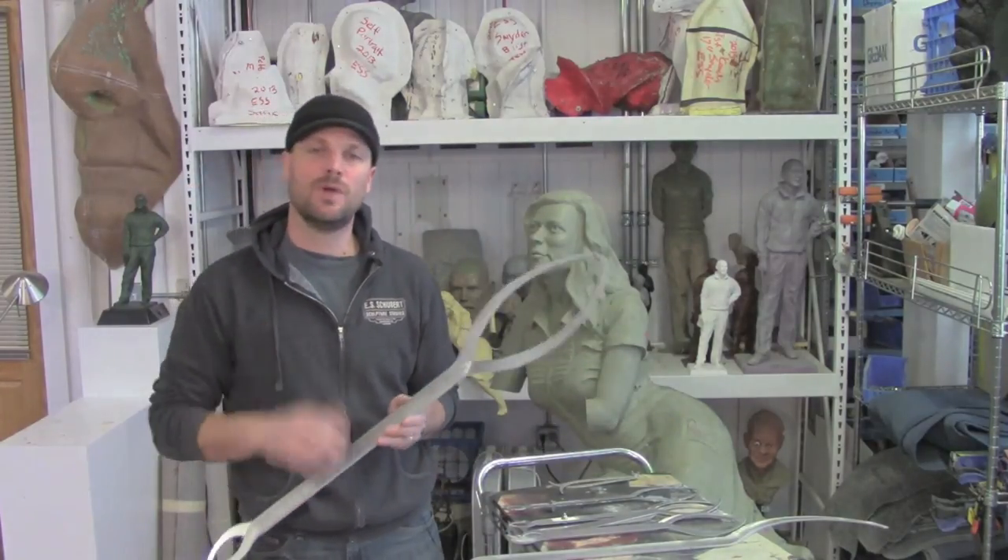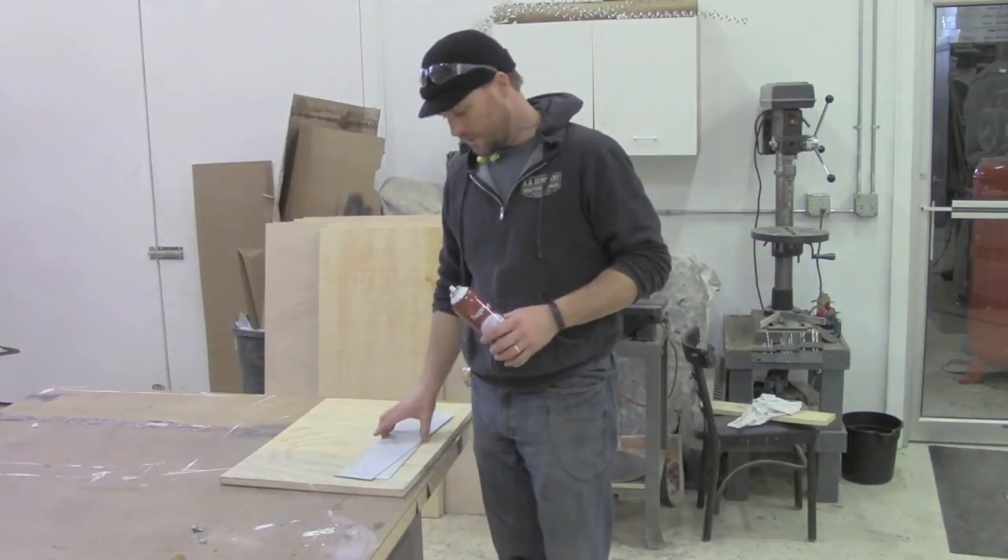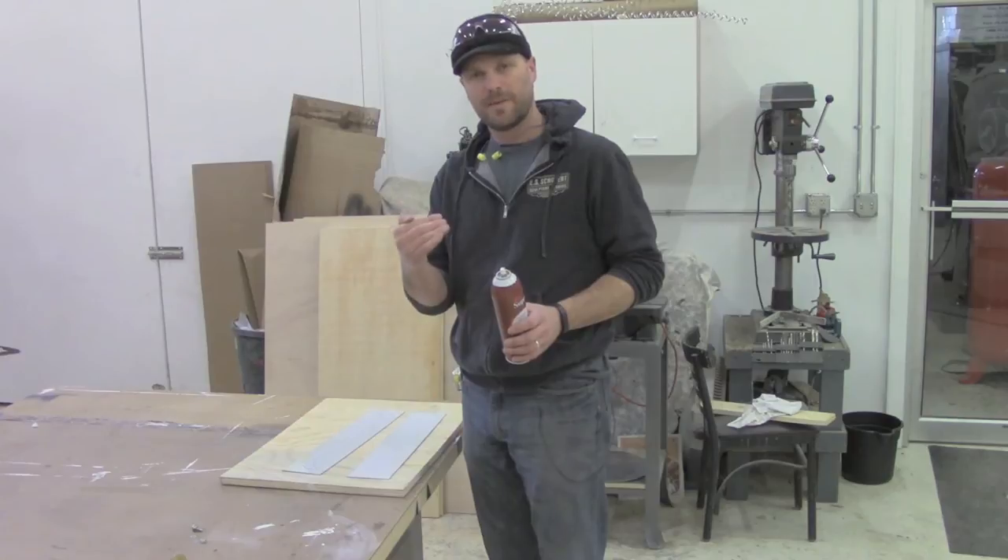Let's get serious and I'll show you how you can make these in your studio at a fraction of the cost. We're down in the shop. Normally we'd cut them in bulk, but I wanted to show you how to do it with your own tools. I went to Metal by the Foot — MetalByTheFoot.com — and purchased two pieces of .080 aluminum sheet. I've traced the template on here using one of our other enlarging calipers. You can print the PDF from the show notes at the correct size and glue or tape it onto your material. We need our calipers to be exactly the same size, so we're going to use Super 77 to glue the two pieces of metal together and cut out two at a time. If you don't have a bandsaw, you can use a jigsaw.